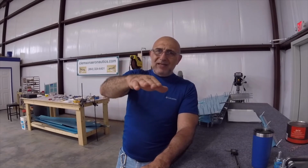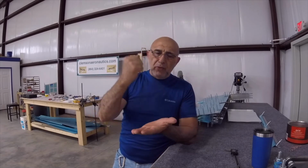Which brings us to a point, which is when you're using your manual machine or our system, the jaws are big. So when you push that handle down, you want to push it down so hard to the point where the upper jaw, you can see it rise a little bit. That makes sure that you put enough pressure on that die to form the dimple correctly. That's called preloading.